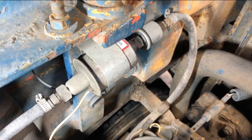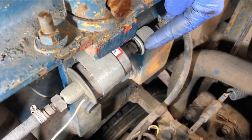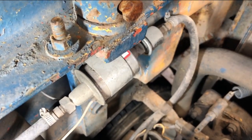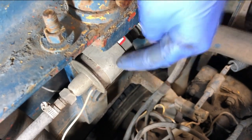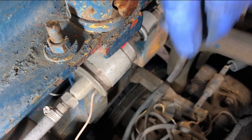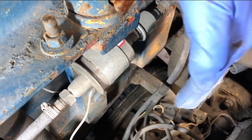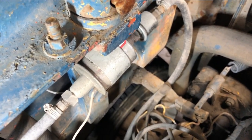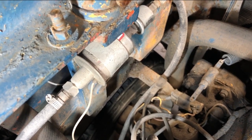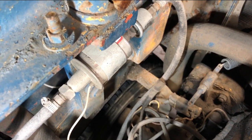So I can see a date on this. I guess this is a check valve. This is 2015. So maybe in 2015, that mechanical pump failed, or before, and this is just a replacement that they put on. But regardless, this pump here is hooked up electrically to the ignition switch. As soon as you put the key to the on position, with or without the motor running, it sends power to this pump. And it should energize or start sending fuel up until the bowl is full, at which point, you know, the needle valve would close and it would stop sending fuel.